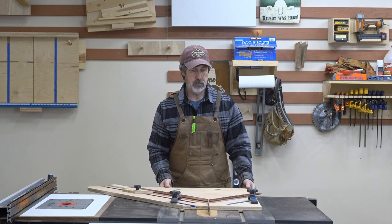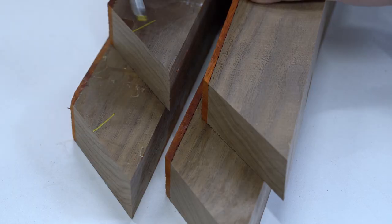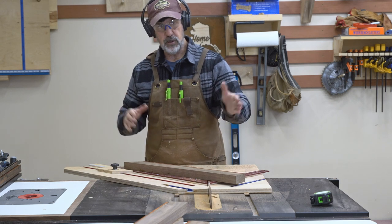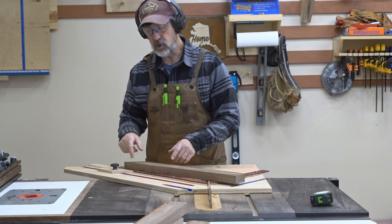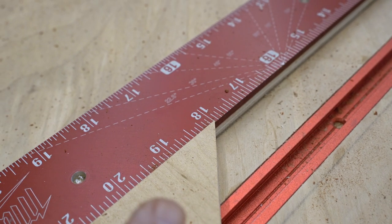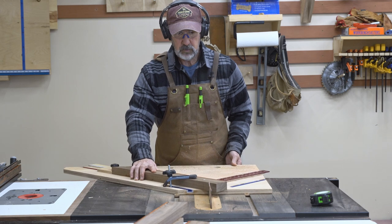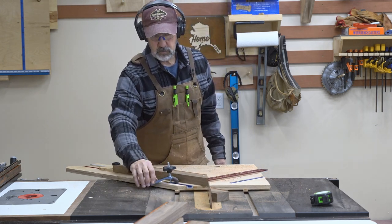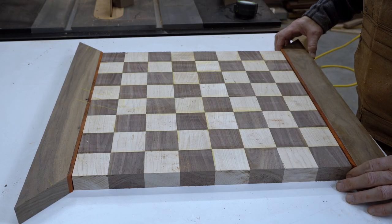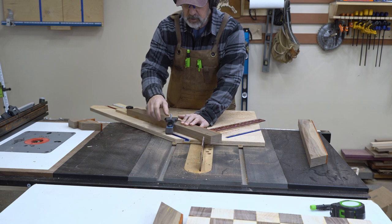Time to get the miter sled out. Time for the second cut on this side. The beauty of this system is all you have to do is measure your chessboard, cutting board, whatever you're putting a border around, and then set that measurement with the 45-degree stop block - can't be any simpler. This is 18 inches, so I set my stop to 18. This is such a crucial step - I always take my time. Measure, cut, and verify fit, then move on to the next one. I make sure to mark all my pieces which side they go to, because as much as you want everything to be exact, it's generally not. This is woodworking after all.